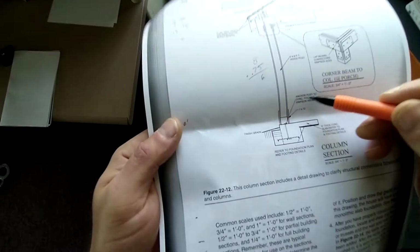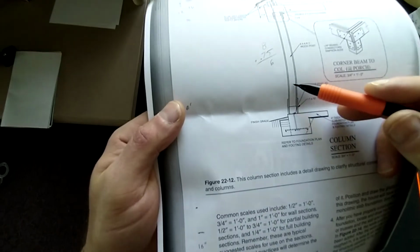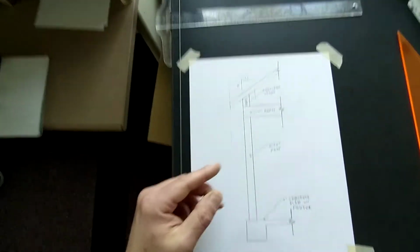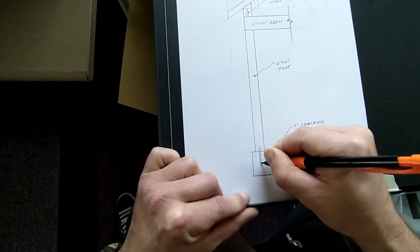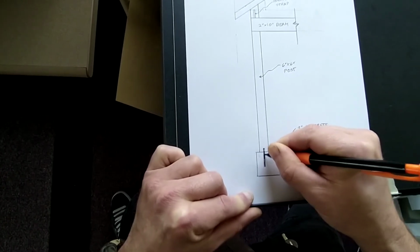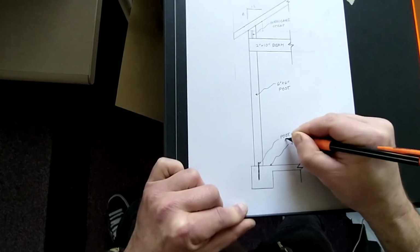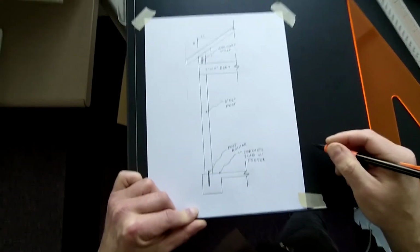Let's see, what else do we got here? At the very bottom is an anchor post. That's a piece of steel, okay? They're going to put a washer, put a nut, take a ratchet, and tighten. It's going to connect this wood to that concrete. This goes into that footer, I'd say a foot. These can kind of vary too. So I'm just going to hand sketch 2 parallel lines and maybe darken this in so they really know that there's some type of anchor. And then come up with another leader line and write in here post anchor.